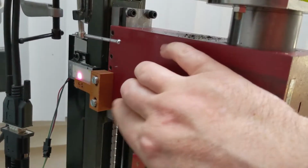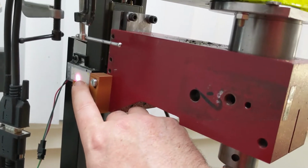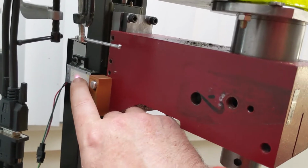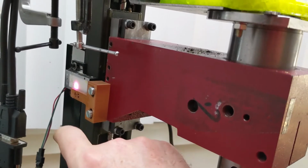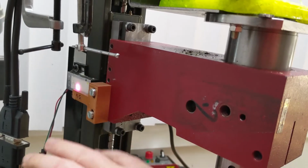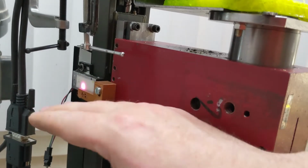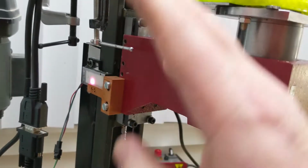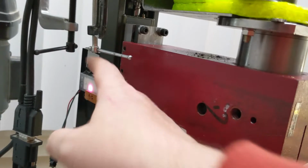So first of all, let me explain what these are. They're Toshiba 3.3 volt Hall effect sensors, and they have an internal pull up, which is nice because it simplifies the wiring and some other things. They shouldn't have any bouncing. Like a mechanical switch, which literally physically vibrates and creates skips in the signals, and you have to debounce that, otherwise bad things happen. This thing is a digital signal, and it shouldn't have any bouncing in it at all.